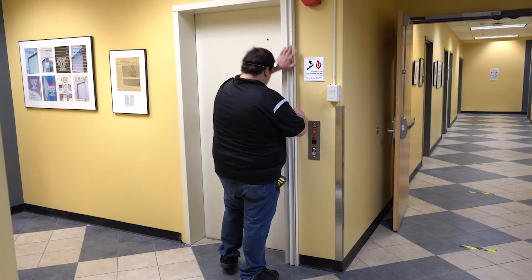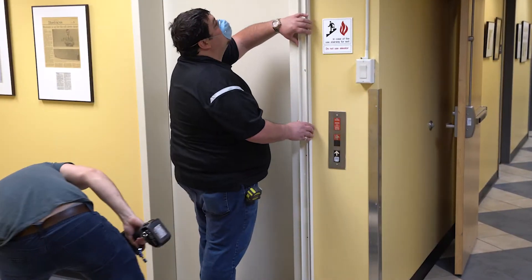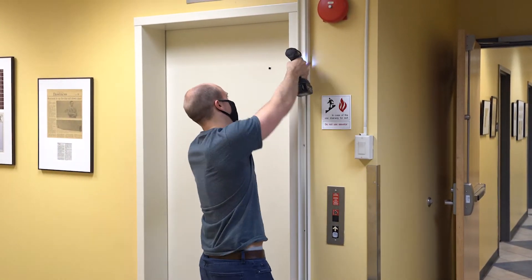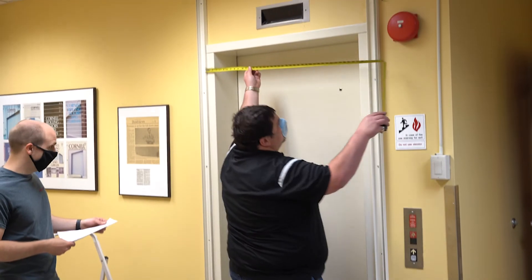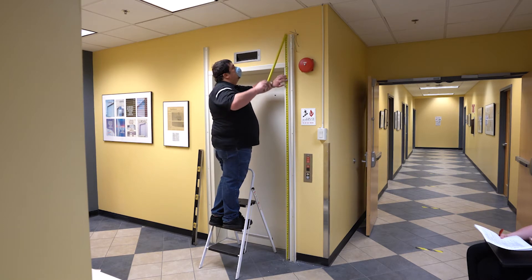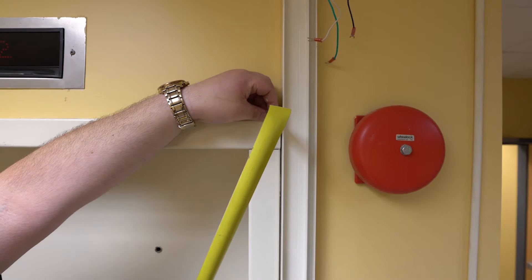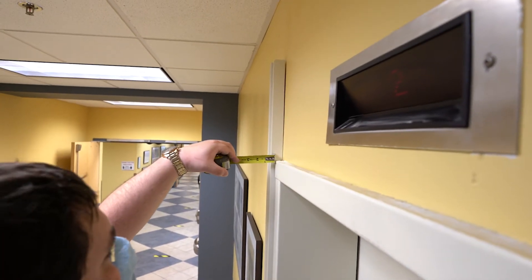We will begin the installation process by loosely installing the wall guides. Make sure the rounded edge is on the top and the channel is farthest from the elevator. Once that is complete, check the following items prior to proceeding. First, confirm that the guides are plumb and mounted level with each other. Then check that the distance between the guides matches the construction drawings and that it is consistent throughout the height of the guides. Next, make sure that the top edge of the wall guides are level with each other and that they match the height to the head box dimension shown on the construction drawings plus two inches. You must confirm that the wall guide clears the furthest protrusion from the wall or elevator frame by at least an eighth of an inch. If that is not the case, pack offs will need to be installed behind the wall guides.